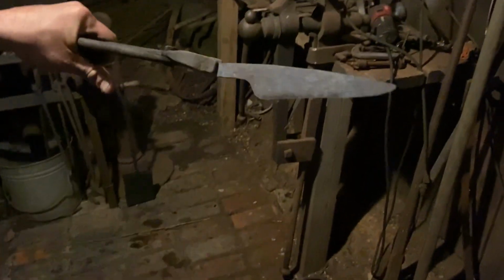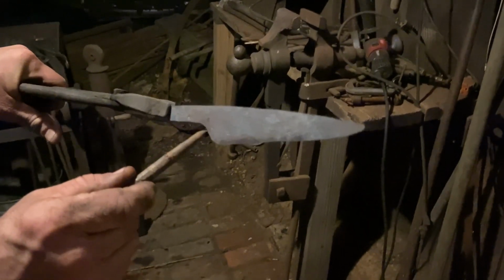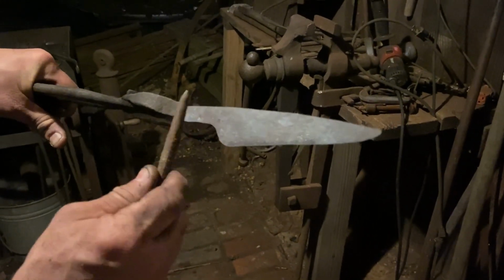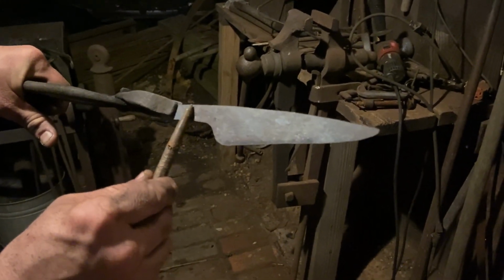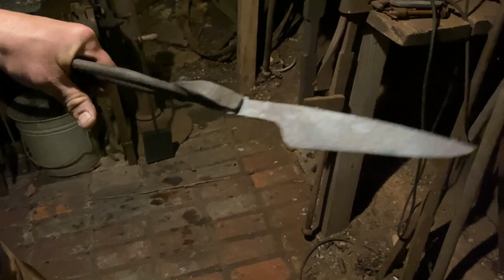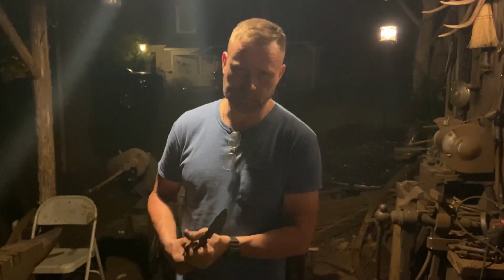But anyway, now I will come back here in this heel and do my little number with the hammer, kind of radius in that heel. Still got to guillotine the tang and draw that out. And that's going to be on the next video. We're going to do a part two of this mountain man knife. And I'll try to get that knocked out soon, like tomorrow soon.